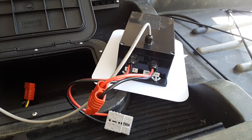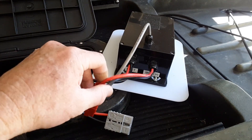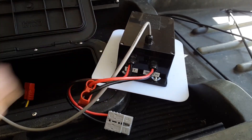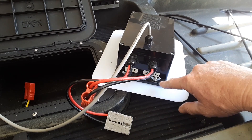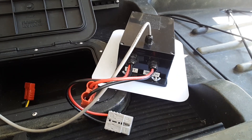This is the PWM I'm using on this 12T — it's going to be mounted in the center hatch. I have my motor and battery connections labeled, and also color coded with Anderson connectors so you can tell the difference, and even if you make a mistake they won't connect together. I have this mounted on a piece of cutting board with four wing nuts so if I ever need to take it out it'll be easy to do, and I'm going to use VHB tape on the inside of the hull to attach the cutting board.